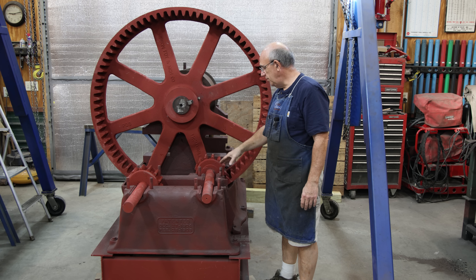Right now I'm going to get in here and start working on these Babbitt bearings. First thing I need to do is get my shafts cleaned up and to size. I think I'm going to use a pouring mandrel for these rather than using the actual shafts, and I'll show you why in just a minute. I was planning on using the shafts but I had to modify my plans a little bit once I got to looking at things.